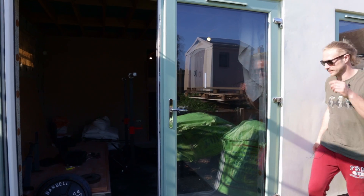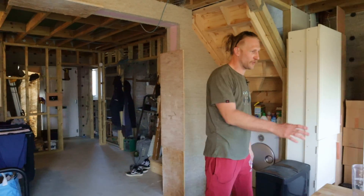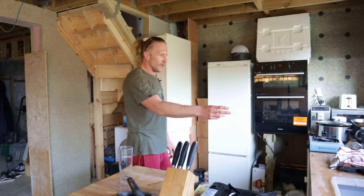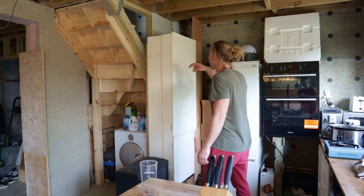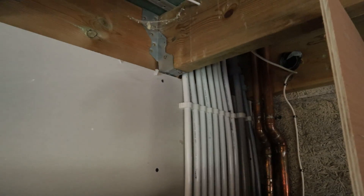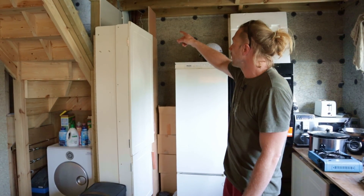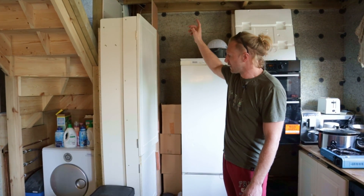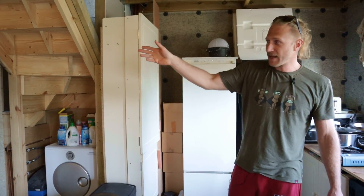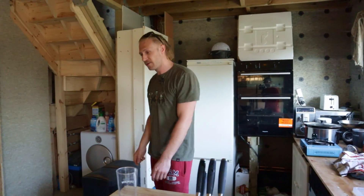Coming inside — I've actually moved into the house already despite it not being finished. I've got the flow and return coming in from the air source heat pump running along the wall and up to the ceiling. In the corner you can see two copper pipes — that's the flow and return — plus the white underfloor heating pipework going upstairs, the wider grey cold water main pipe, and a smaller grey pipe which is hot water coming down from the cylinder feeding the downstairs tap and temporary kitchen.